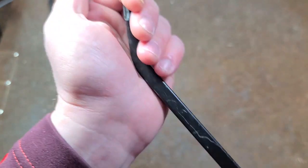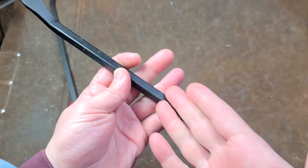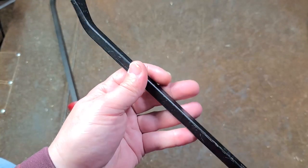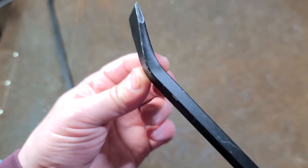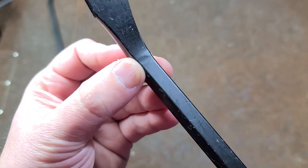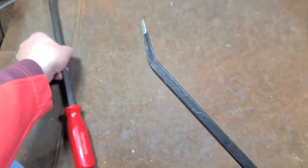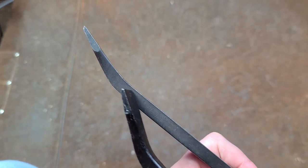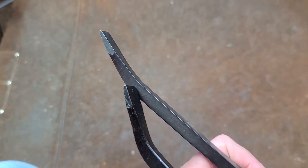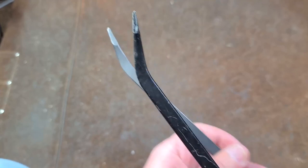I was doing some looking and some people had complained that if you put too much force on a 3/8 shank or bar like this it's going to bend, but really it was the fact that it would want to bend right here, right where the initial offset is. They use a really sharp break and the bend is actually pretty tight. Even though this bend is shallower, so it kind of makes it look wider — it actually is wider — there's just a longer radius where they did the bend here, where it's really sharp on the Cobalt.